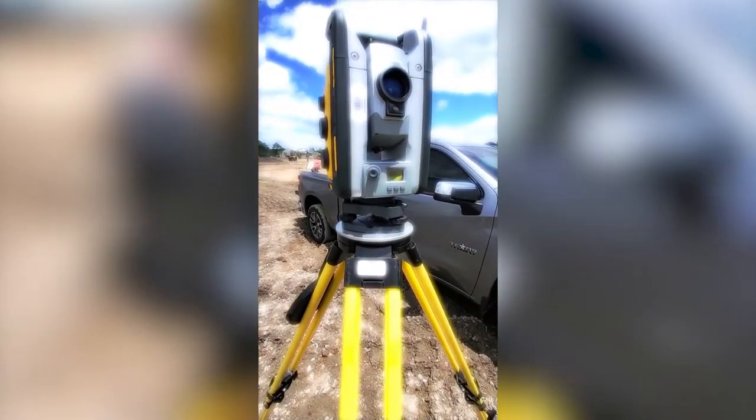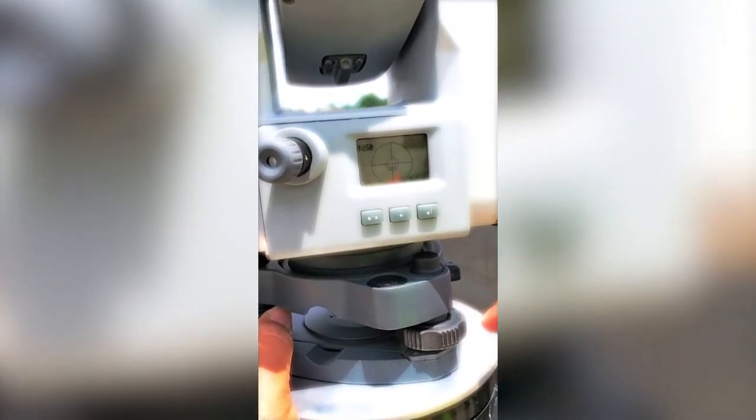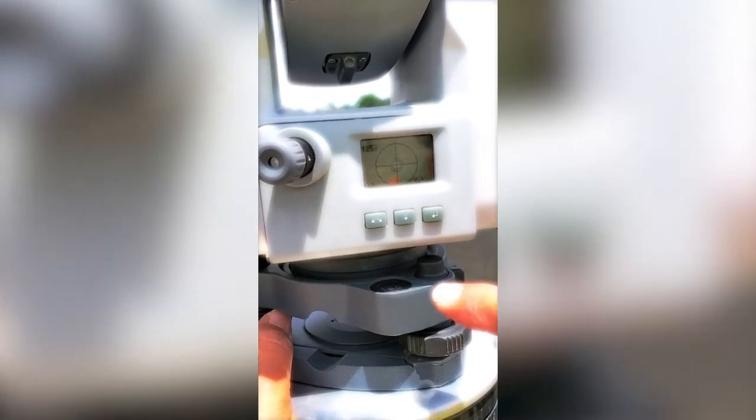So here on the faceplate, you'll see the Trimble emblem. It'll say starting. We're going to go into the second phase. It's going to start counting down. We're going to hit the enter button for setup level. So at 1 in 250, you see it's in the bubble. That's still not accurate enough for machine control. Hit the down arrow, 1 in 100.